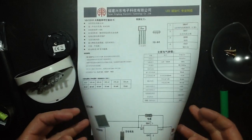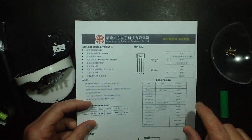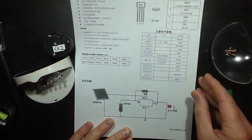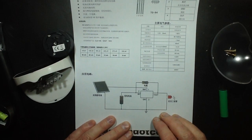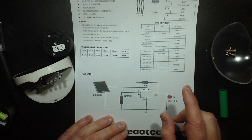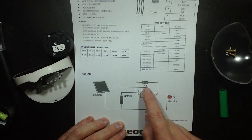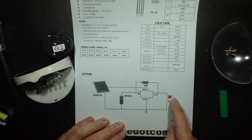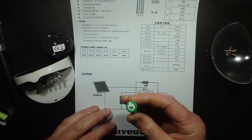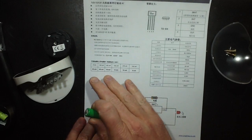There are many variants of the 5252F — it's a very simple 4-pin chip. There are so many different number versions of this; I'm not sure if they're just everybody making their own version, or if they're coming from one source and rebadged. I think probably they're from different suppliers. They're very simple — basically it's the inductor, the chip, the LED, the rechargeable cell, and the solar panel. It's really designed for solar lights.